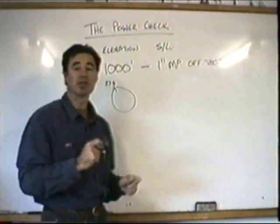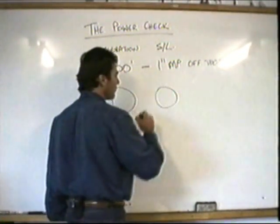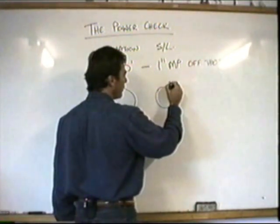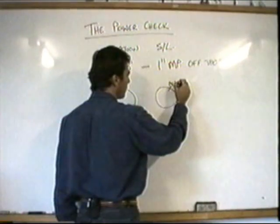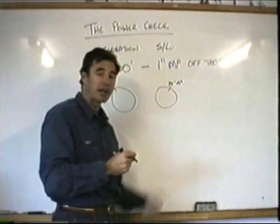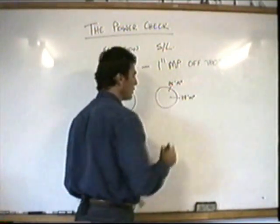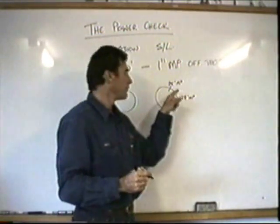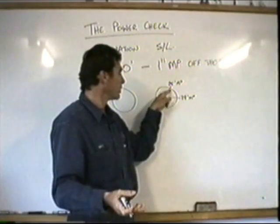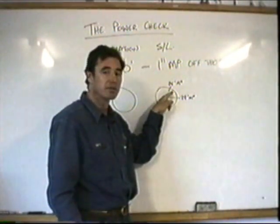Now in the Bell 47, what you got is what you got. In a Robinson, it's a slightly different case. They've designed that and they've derated the engine. So that, let's say they've got a red line of 25 inches of manifold pressure. You guys probably know that if you kept pulling that collective up, you'd get to about 28. Now you're not allowed to use that. You can if you're getting into dire straits and you're going to bang into a tree. There's nothing to stop you pulling over that to get yourself out of trouble, but you shouldn't as a habit be using all of this.